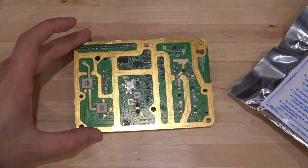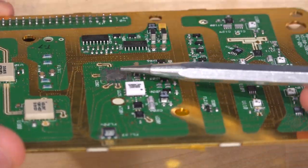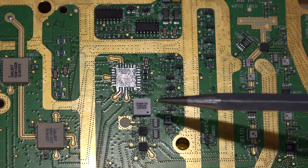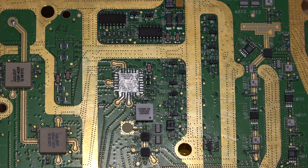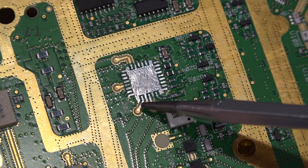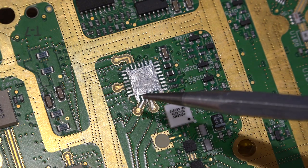Now we have to talk about what's actually going on on this board. I spent some time removing this component and you can see I made it as clean as possible. These packages are extremely sensitive, so I had to cover things and very, very slowly work my way to remove this package. Let's talk a little bit about the challenges of reassembling this. If you look at the RF interfaces of this chip, which are the ones on the corners here, these are all coplanar waveguide transitions.